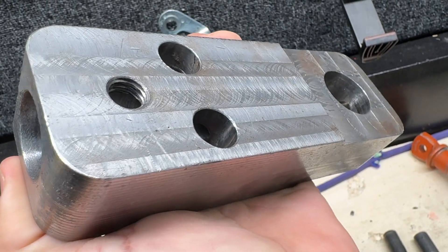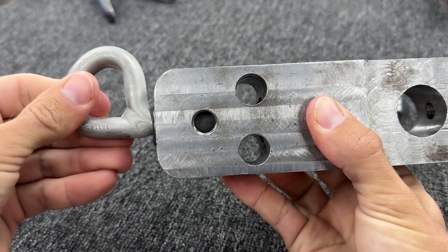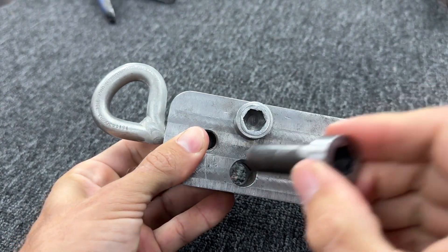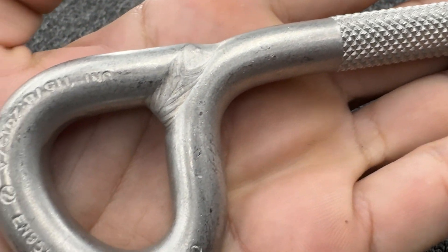We used pipes that Lucas and his son Abel hollowed out and put threads in, plus an adapter it fits in. Every time we break something, we can just pull the pipe out and replace it with the next sample, making the tests more consistent and easier. We're pulling it straight out of the hole because that is going to be the worst case scenario for the epoxy. We used the strongest bolt in our store and kept the same bolt across all tests — the only variable is when we pulled it, whether it was wet, and whether it was frozen.